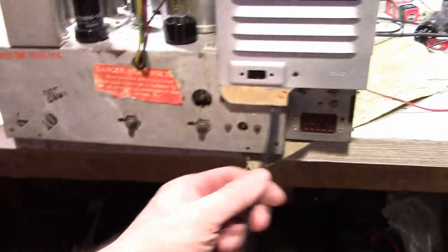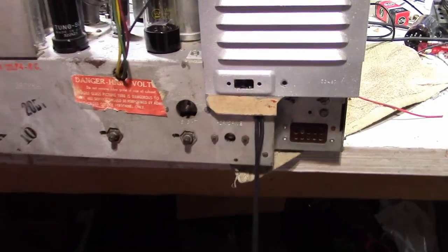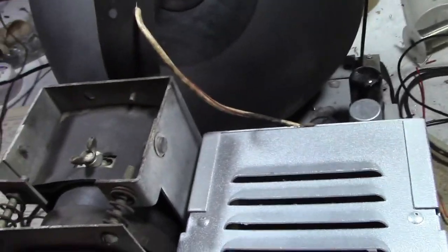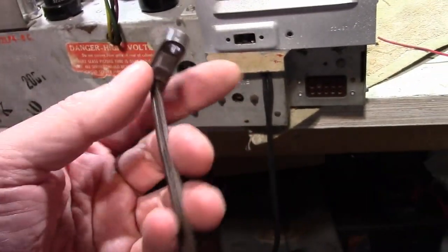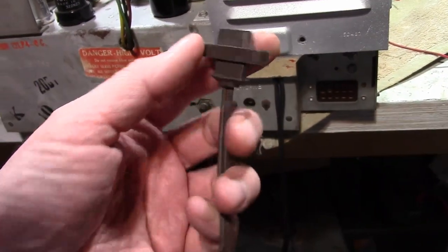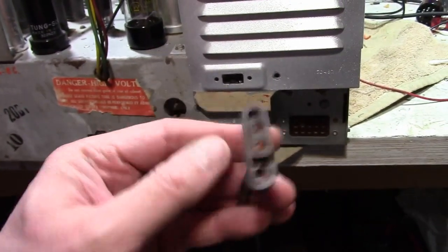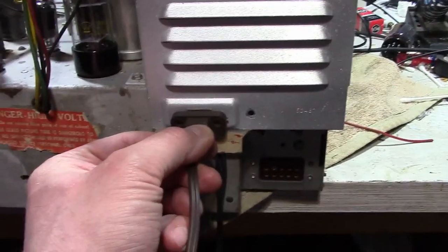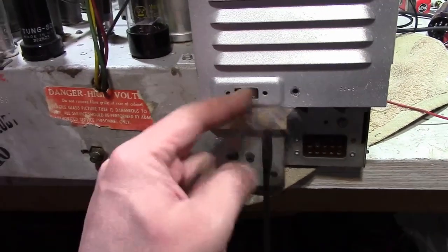one thing I noticed right away is the power cord. There's supposed to be a safety interlock here. I got the original power cord to look like right here. I have a small stash of new old stock replacement ones. This is it, non-polarized, it's got ears on it. This would have been riveted in like so. And then there'd be a corresponding two-pin interconnect on the other side.